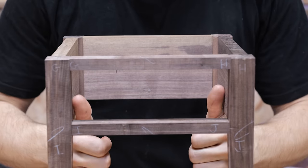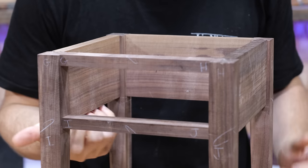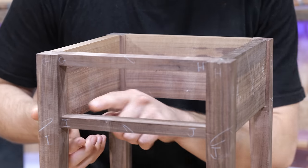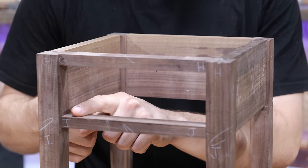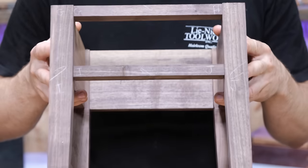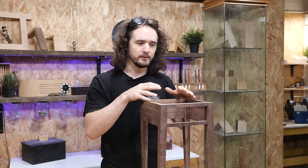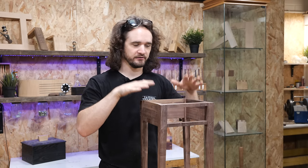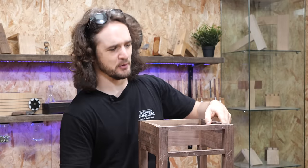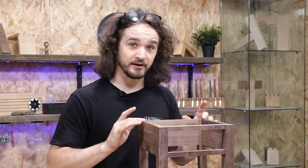In addition to cleanup within the cavity, we've also got some drawer runners to add along the bottom and along the top. These could just be glued into the inside face, but that can get a little bit messy. It might be difficult to clamp accurately because these drawer runners need to be perfectly aligned with the front rail, and they need to be parallel across both sides so that the drawer has a parallel cavity. We also need to plan out fixing points within this carcass so we can attach the top later.